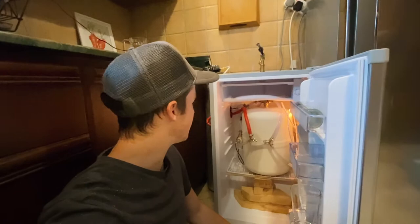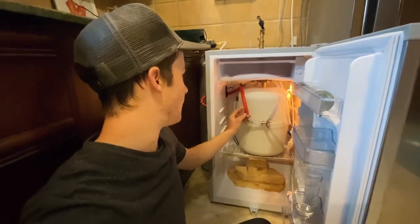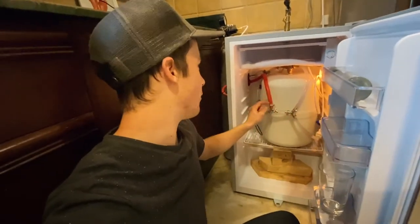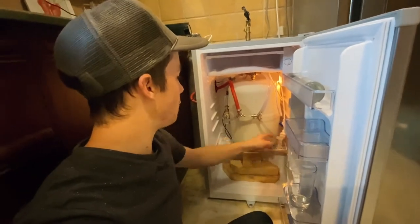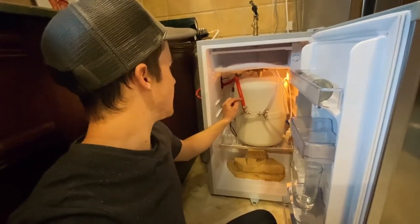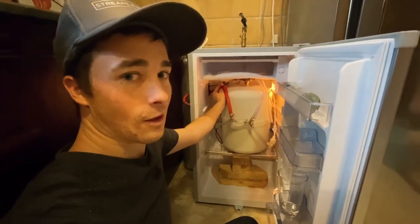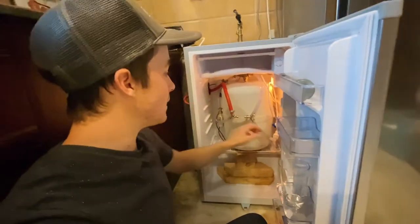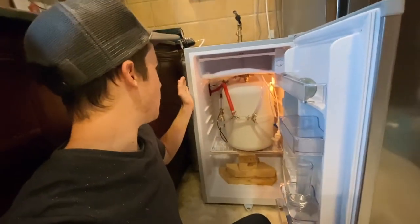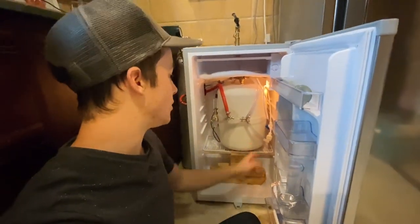Cheers. So I understand this is a little bit complicated — with 40 PSI coming in and 25 or less coming in from the air, the water inlet can overpower that, sending water up into the CO2. But ultimately, for the water to overpower the CO2, it has to compress all the air in that tube. And when it's compressing, it would reach 40 PSI before the water gets to the CO2 tank. I try not to just leave it open while that's open — I'll monitor it until it reaches 25 PSI and then shut off the water.